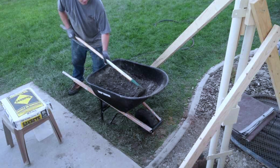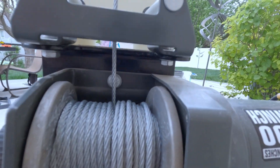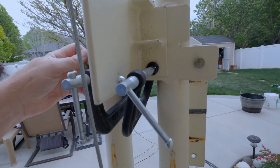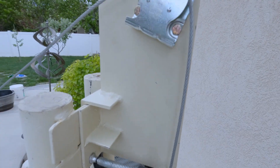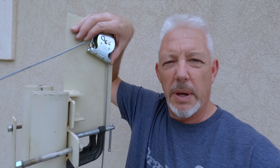To keep the center poles aligned and not moving, I've got a center bracket of quarter-inch plate to keep them in place. I had a machinist weld on a bracket which is the winch mount plate, and I was able to drill holes for this specific winch and the hand crank winch I had originally. I also had them make a plate that sits at the top — I used some C-clamps to hold on to it. It could have been a better design but it's worked for my application, and what I mounted to it was a wall mount pulley rated for 480 pounds.